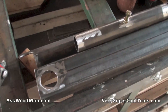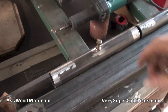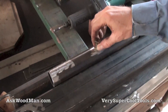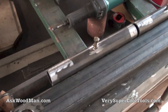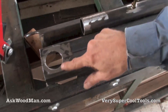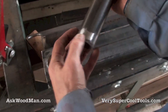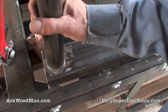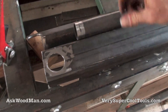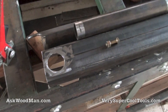I've got all my parts ready to weld up the sleeved part on the top. You can see I've got my area bright and clean for the bolt that's going to make the height adjustment. I've got the bottom side — I'm only going to weld the bottom side onto the pipe, and the pipe is all bright and clean. I may weld it on the top too, I'm not sure — this is not that thick, so I think I'd run the risk of busting through it unless I was real careful.